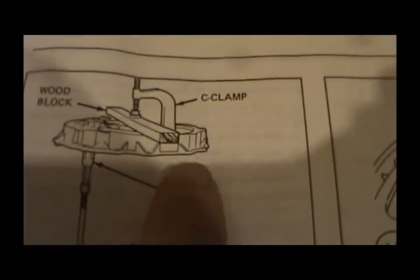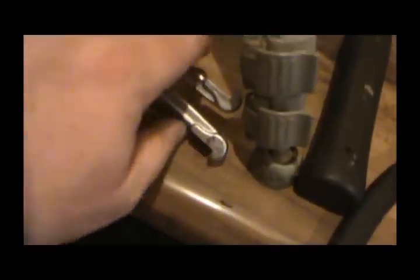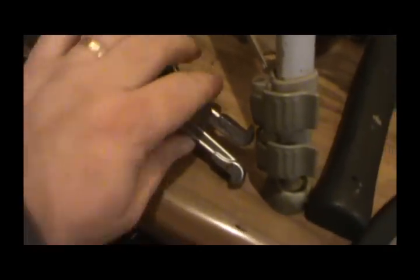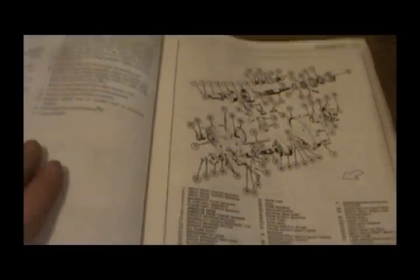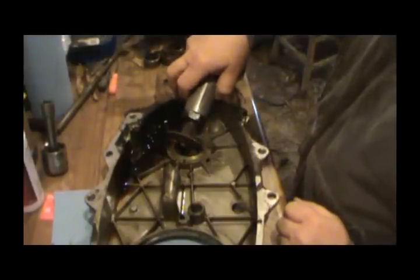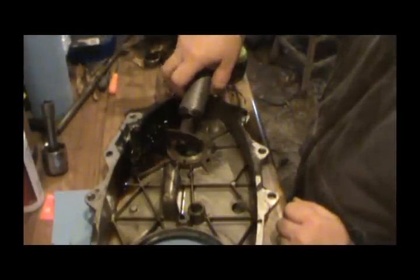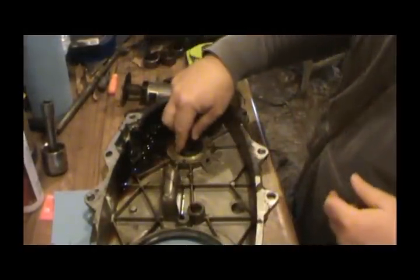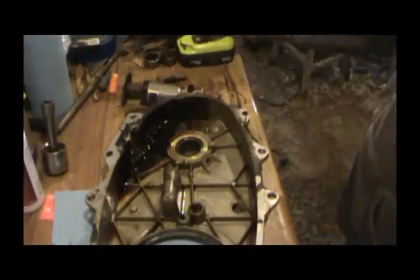It's showing a wood block and a C-clamp. I couldn't find the picture of that tool but it's basically a blind bearing puller, similar to this but probably a lot smaller. So we're gonna do basically the same thing, except first we've got to knock the bearings out to get to the race. I'm gonna set you up and take my little arrow tool and get those bearings out of there. I'm hoping I can just notch this bearing - may have to notch it on two sides - but hopefully I can just get a little notch going and knock those roller bearings out.